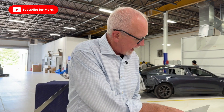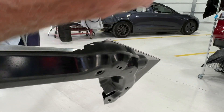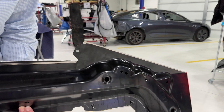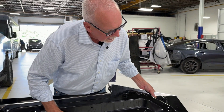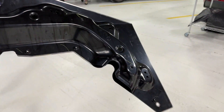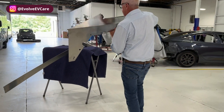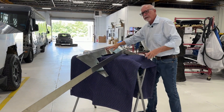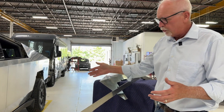It's literally bent, and super interesting when we look at the exterior panel — there's no return on any of these panels, it's just a piece of sheet metal essentially. The inner structure looks more traditional and is clearly a stamped component. The exterior panel is adhered to this inner structure with just a handful of bolts attaching it to the vehicle. It's fairly simple to take apart — frankly probably one of the simplest Teslas to dismantle. Their design thinking for simplicity of manufacturing flows nicely into simplicity and ease of repair.